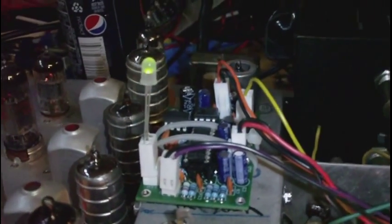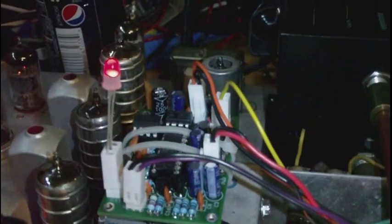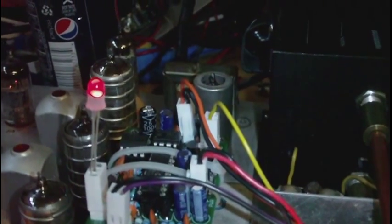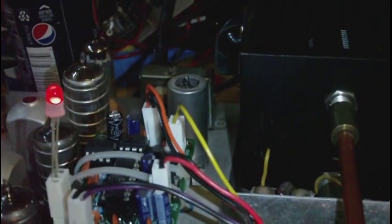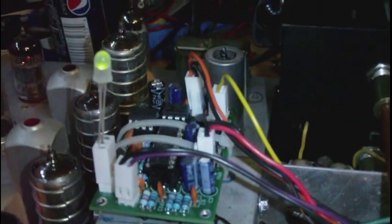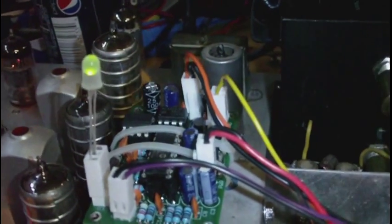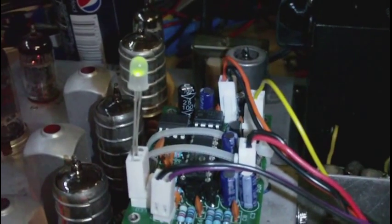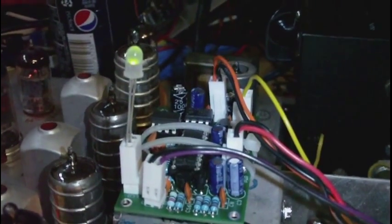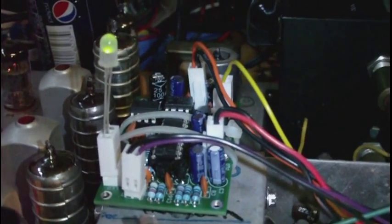This green LED shows you the status of the device. If I bump the frequency it goes red — that means it's detected me tuning. Once it's been sitting on a certain frequency it switches modes. When it's red it's not correcting frequency; when it goes green it's locked down. So as long as I don't physically bump the radio, the frequency will stay right on. I've tracked it from power-up through several minutes of operation and it's not drifting at all.